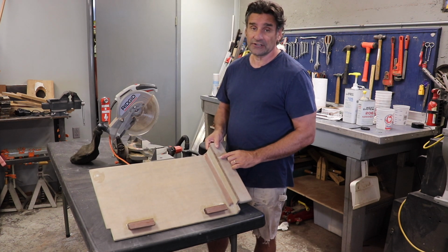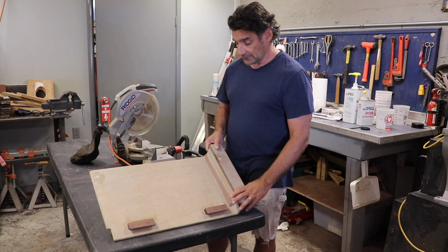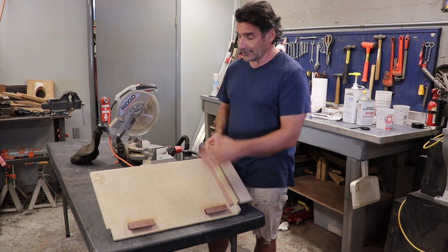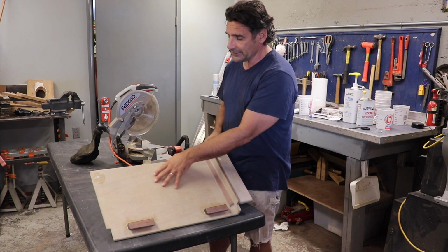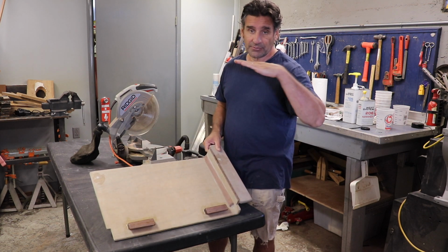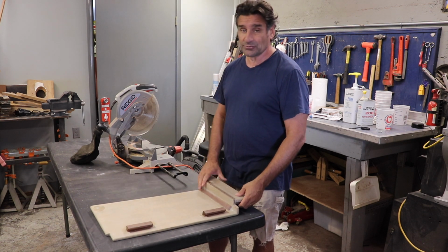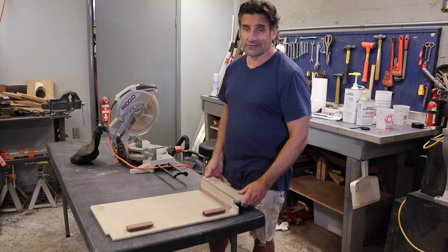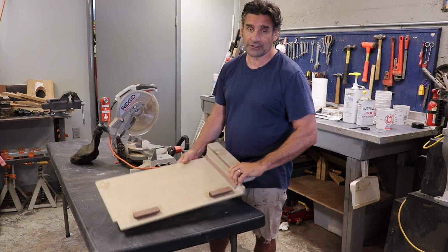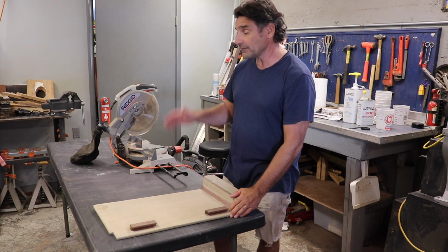But since I had some voids in there this morning when I looked, I had to fill those voids. And yeah, grind it out full of voids. It wasn't a lot of voids, it was just something there. And while I had the epoxy thickened and ready to go, I just covered up all the shallower ones as well, just to make sure I had enough material on there so I can sand it off nice and flush and flat. And so I did all those this morning. So my idea was just to sand the front sides here and go over to the boat, but I've got to wait for this thickened epoxy to kick off before I can sand it. So anyways, I've got to do something else.